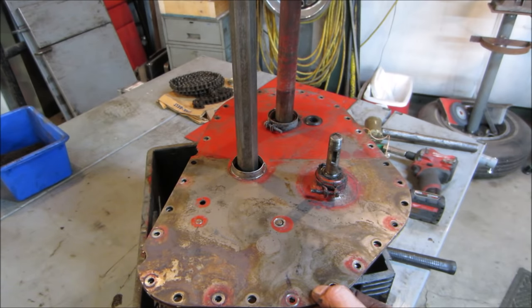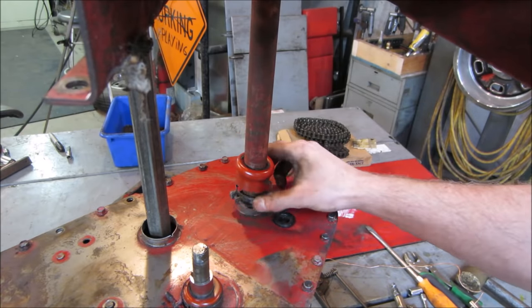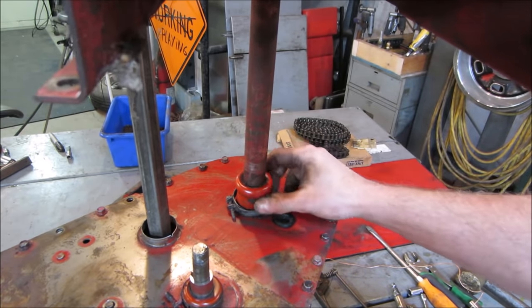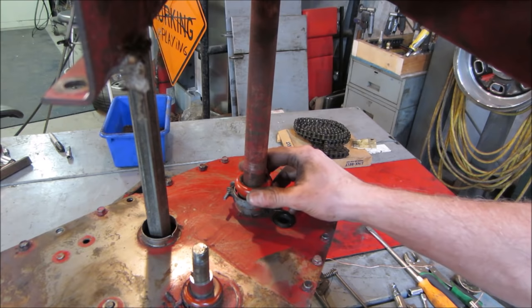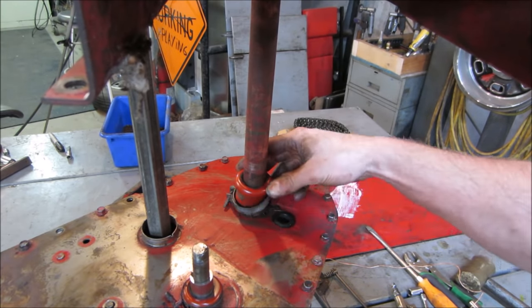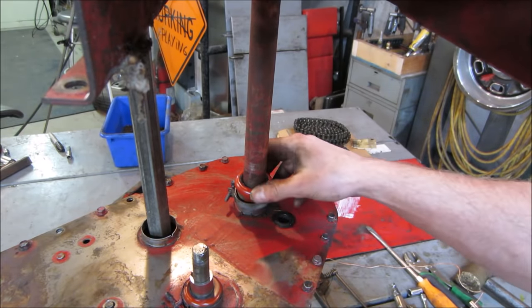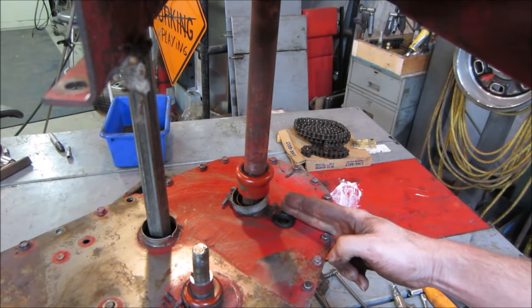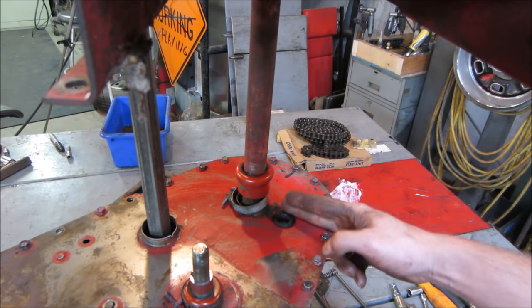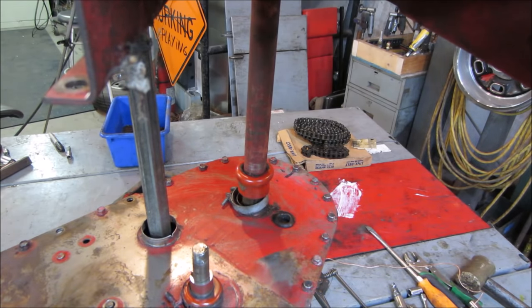Again, that makes the little bit of air gap that was there with the cork gasket. So they're all kind of cinched down. Again, there's a gap in between there. One thing is, you would think they would have a better seal than that. This is the only thing that they use for a seal. That goes over the top of them and gets clamped, but it's not. I wouldn't exactly call that weather tight, but it's kind of like a chain on a motorcycle. It's not that important, but if you drove the thing into water, that thing would just fill right up and you'd get water down inside there. And probably the drain plug, you probably fill it only to about right there, to the top of that plug anyway. And then as everything spins around, it just splashes up against it. I'll probably go for a really thick gear oil maybe.